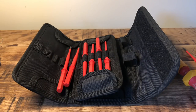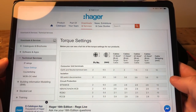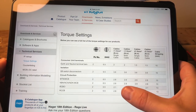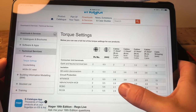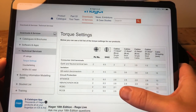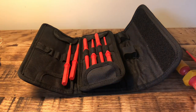So what do we do — just tighten it up to whatever we want? No. Let's look on the Hager website. I've gone to the Hager website on the iPad, and if you just Google 'Hager RCBO torque settings' this is the page that comes up. They do give you standard torque settings for their different products. For the RCBO, it says to use a PZ2 or a flat 5.5 screwdriver, and for different cable sizes — although in this case they're all the same — the torque setting for a Hager RCBO is 2.1 newton metres.